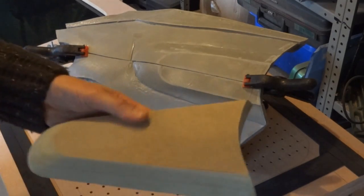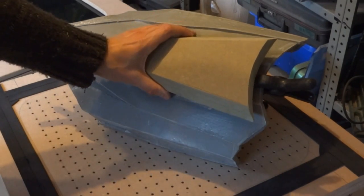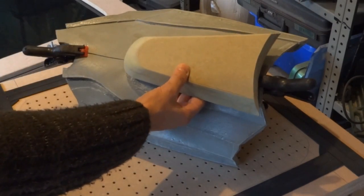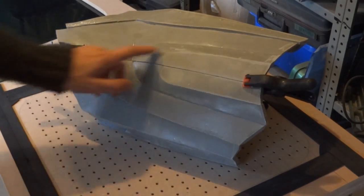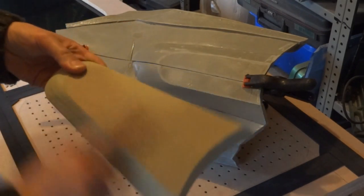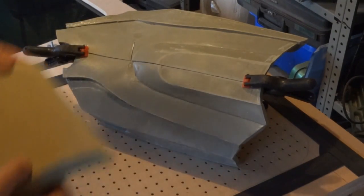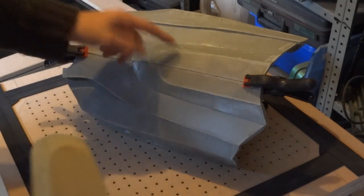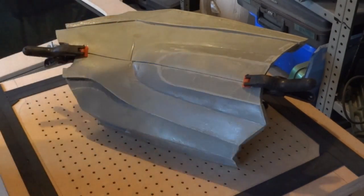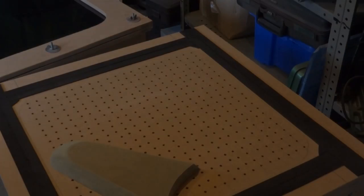Basically, I'm going to make a plastic shell out of sheet material, vacuum form it, make two of them, and stick those over the top. This one will be cleaned up the best I can, but it's much easier to start from scratch rather than sand and fill this one. It will also cover the seam line. So let's have a look at the vacuum forming table.